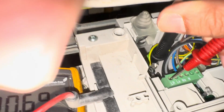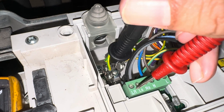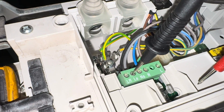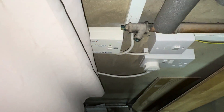You can also test that by putting a link in between LS and LR. Not all receivers will have LS - they'll just put a link between common or the permanent live and whichever terminal is there.